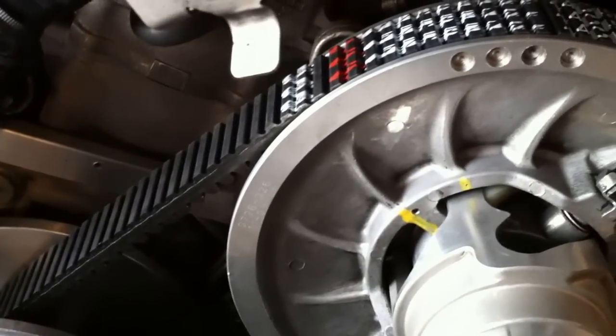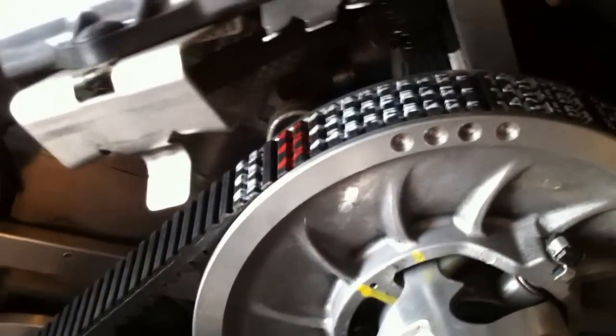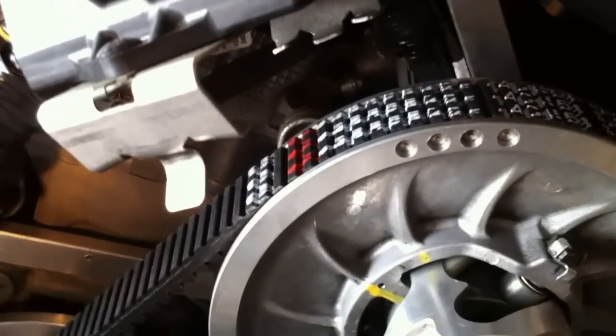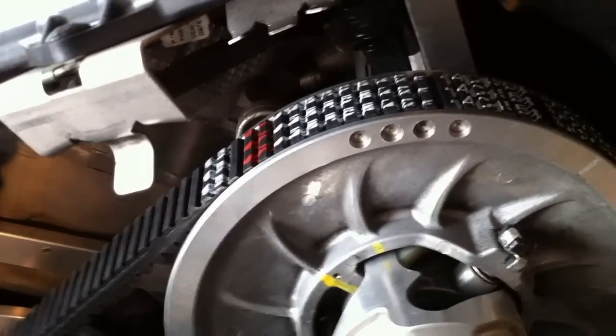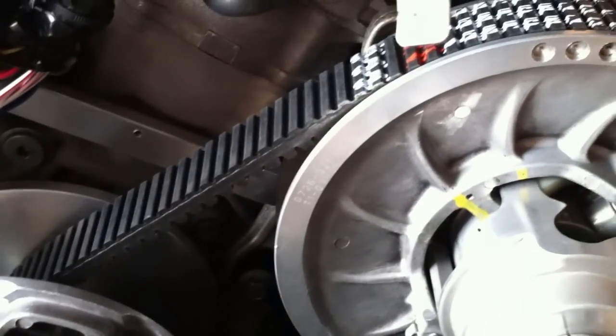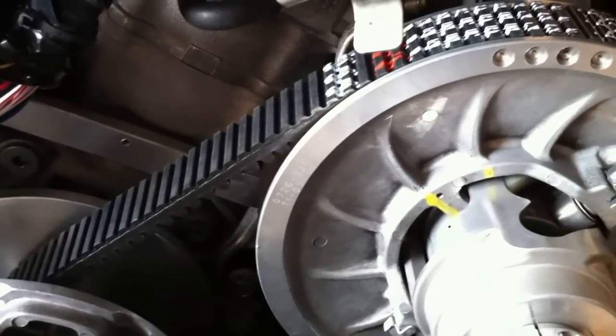It's about 1.44 on the width and about 46 and 5/8 on the length. Really nice size. It will only work with, at minimum, a Dalton DSSA-2 shim. You need to be shimmed to run this belt.